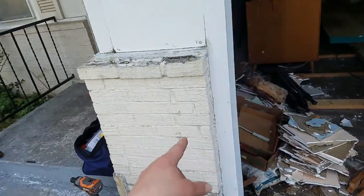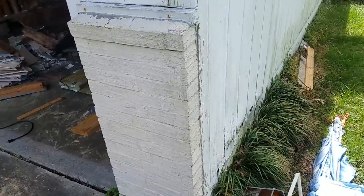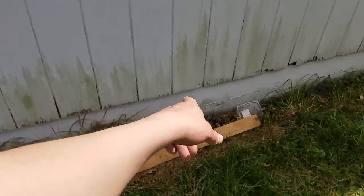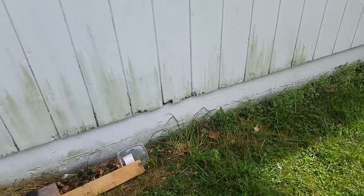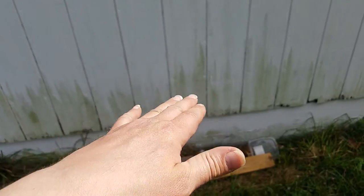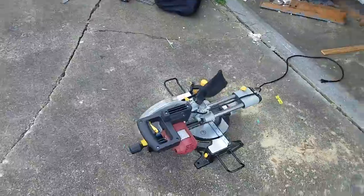All this brick on this wall - and as you can see that section is already out. I didn't actually get into this side yet to see if any of that is bad. If it is bad - oh man, this is becoming a nightmare - because all along there it's rotten. All this siding is just rotten, so I'm assuming that whole sill plate on the foundation is gone. I don't think there's a secondary sill plate and I'm just crossing my fingers.